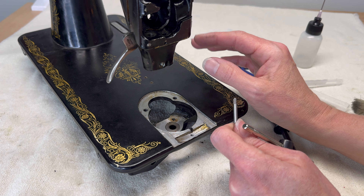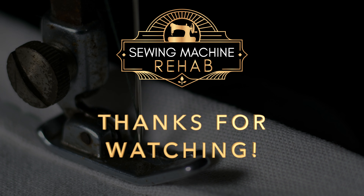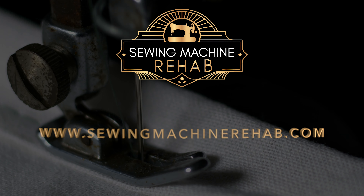If this doesn't work, the next size up is 3-48s and that's what I'll try to tap the hole out with, then hopefully find a screw that will work. As I go a little bit at a time, the proper process would be to back the tap out and then back in — that frees up all those little bits of metal that it's shaving off. I'm looking at the bottom; I want to see when the tap finally starts to poke through, and it's not just yet, so very slowly and carefully I'm going to proceed.